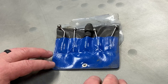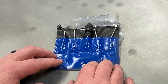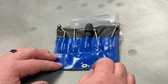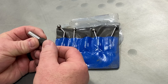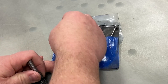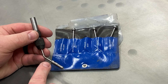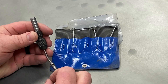It includes a number of probes and a body that allows you to use a simple device to locate hole centers, edges, or — in the case of what we want today — needlepoint precise location of a spot on a workpiece. Its main body is essentially a ball socket collet with a finger-tightened nut and four different probes. The first probe is an indicator holder, which snaps in like all the others, but it is never run under power in the spindle — it's always mounted stationary with an indicator attached, swept by hand.